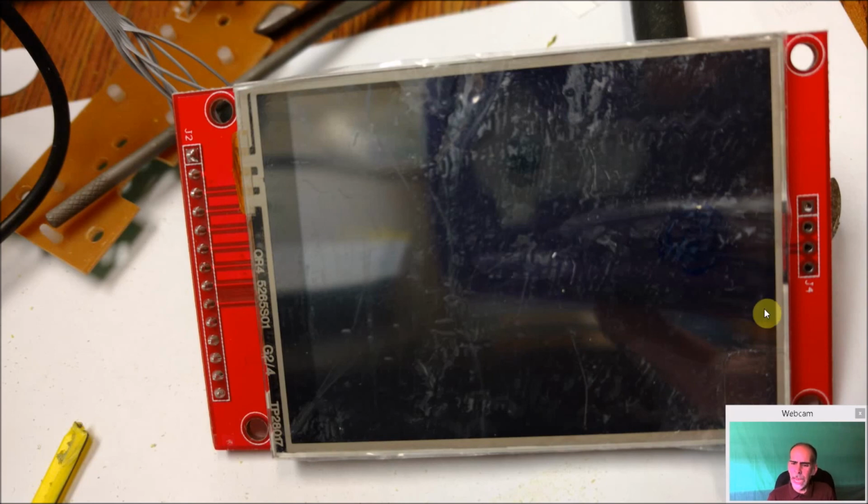Now again, when the machine's on and you're playing it, you don't notice it at all. And if anything, in Space Invaders, they had a planet down here, so it's fine. But when it's on, you can't see it. But when it's off, you can see some speckles in here, and it's just bugging the heck out of me. So I'd recommend just putting a piece of tape over this area when you're cutting it, and that would alleviate that problem. So my oof is your salvation.